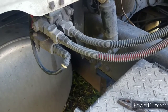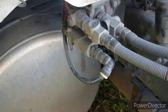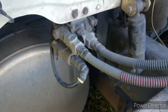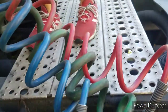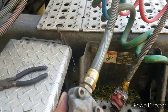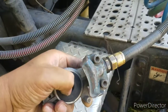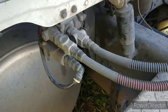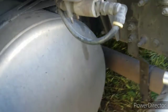Okay, truck drivers, here with the Freightliner again. My problem was that there was no air coming out of the service line — the blue line — when you apply the service brake, so no air coming for the brakes on the trailer. I followed the line to trace the issue.